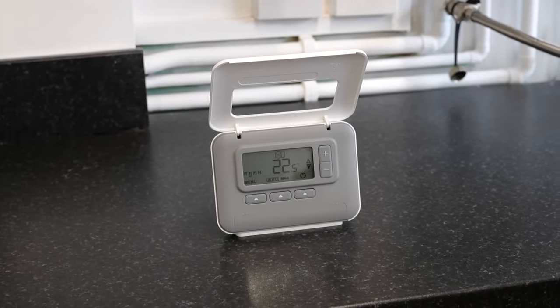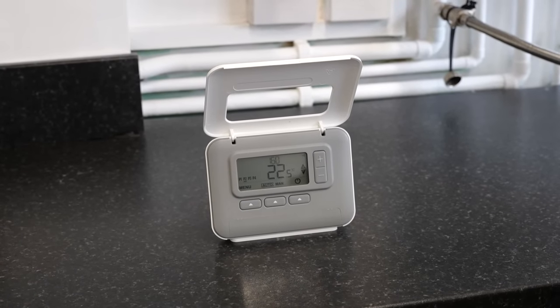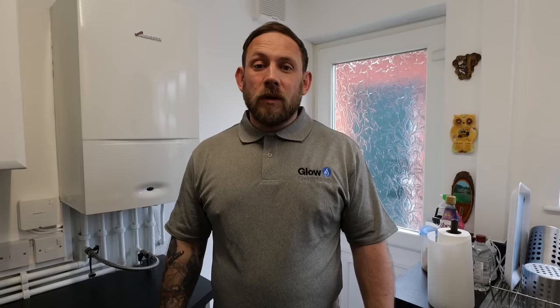So if you leave it in auto mode now, the boiler will come on to the times and temperatures that you have set in. A couple of things to note: one of the biggest queries we have is that people don't understand why the boiler comes on within the off period on the programmer. This will usually be because the set temperature is too high. If you do not want the boiler to come on at all within the off period, you need to set the temperature as low as possible, which will go down to five degrees on the programmer.